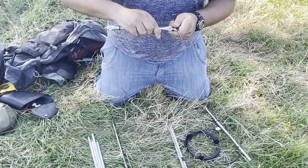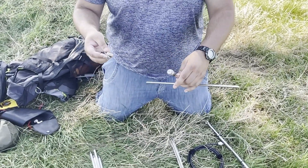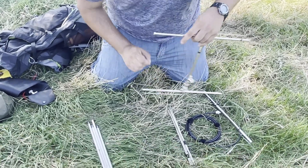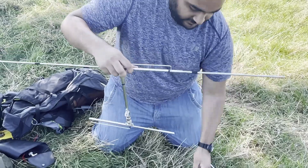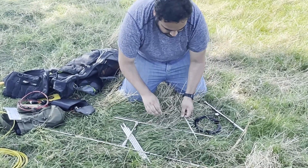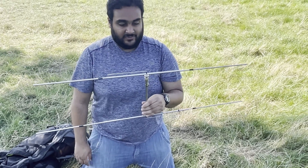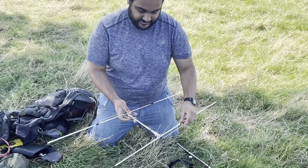Assembly is very simple — all you do is screw the antenna elements into place using SO-239 and PL-259 connectors. The thing to watch out for is to have the gamma matches on opposite sides, because that's how the antenna works. Push the elements in and be careful because they are a little fragile — I had one break the second day I owned this antenna. Wimo were nice enough to send me a replacement free of charge including free shipping, but just be wary that the gamma matches might be slightly fragile.